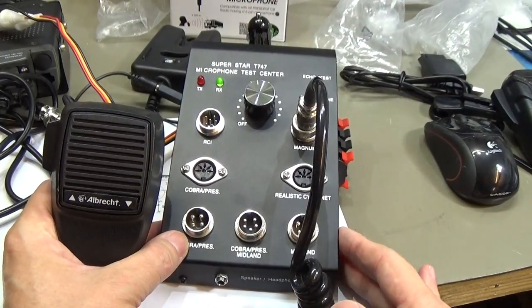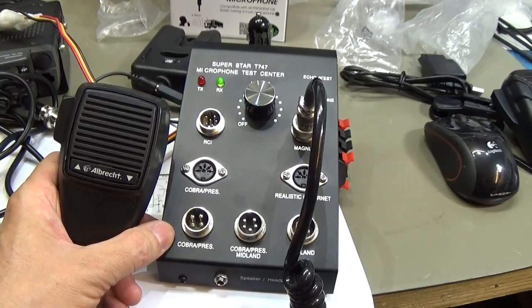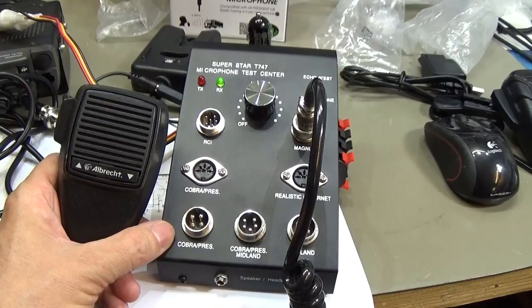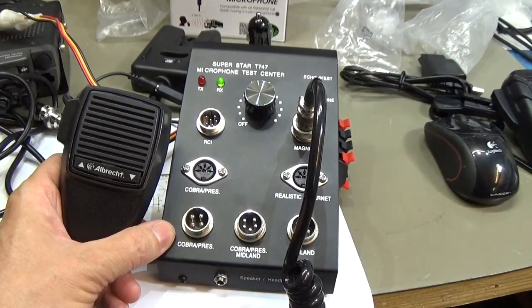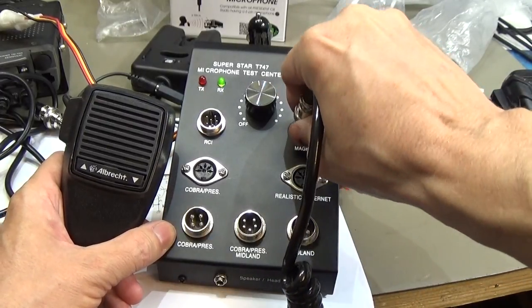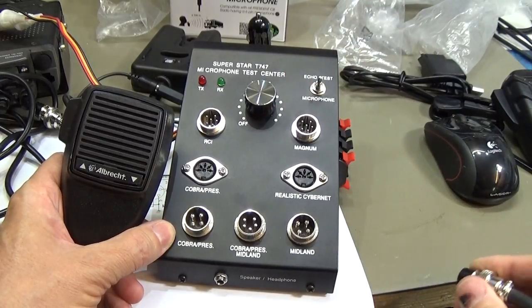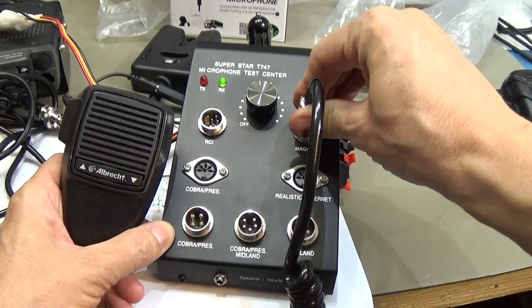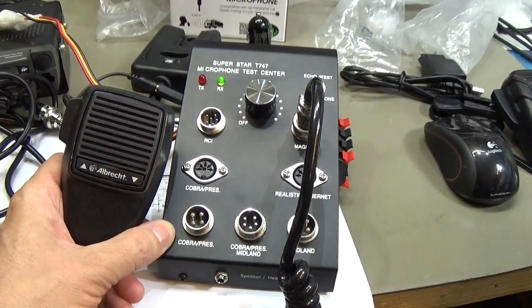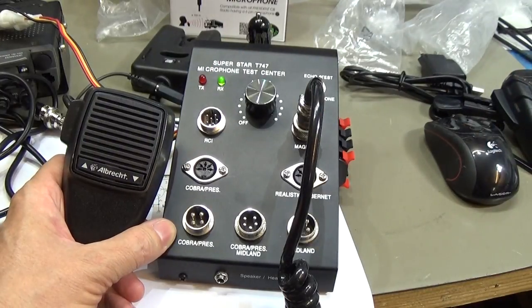So that is only the information that the speaker circuit is looped and is working, because, as you may have recognized with most CB radios, when you take away your microphone, you do not have audio any longer, so you always need to connect your microphone to the radio to get audio, right? And that is the indication that this is working.